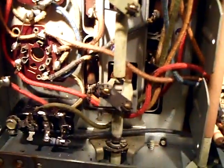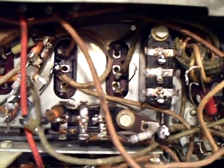It's a good thing I have pictures, because I got this section all apart and the picture shows exactly how it all goes back together. I'm going to finish working on these and go somewhere like Home Depot to get longer needle-nose pliers to get in there. It's okay to do things like soldering to an existing lead - I saw that on Retro Chat. Sometimes I unsolder from the terminal and put the new lead on for a neater job, but for something like this, soldering to the lead going to the coil is perfectly okay.